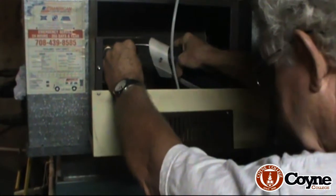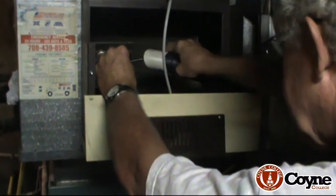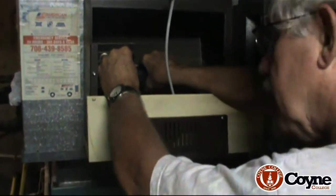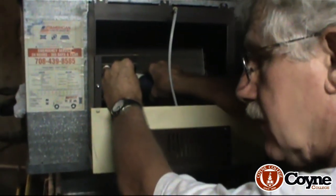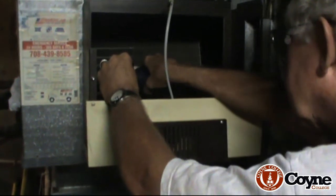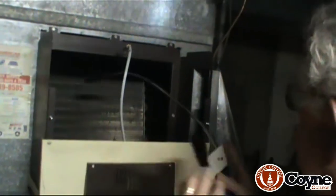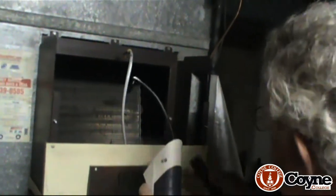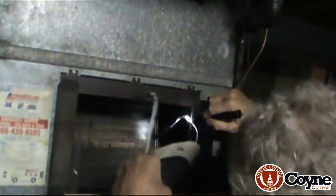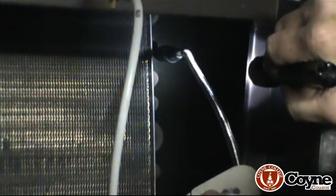This is the first place I would check, it's so old. Remember that refrigerant — most refrigerants we handle, R22 and R410A — are heavier than air, so it would pool probably in the drain pan down here. We can also go on the other side. So we just take our time; I'm looking at the U-tubes here. I don't see any oil at all.